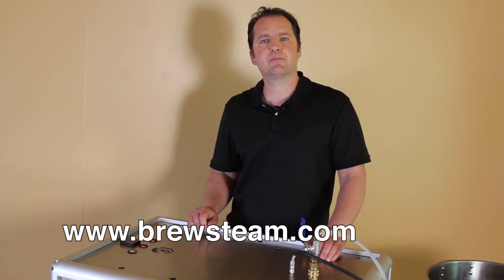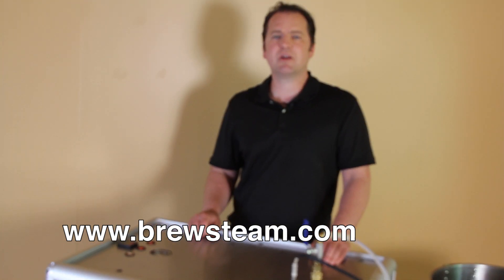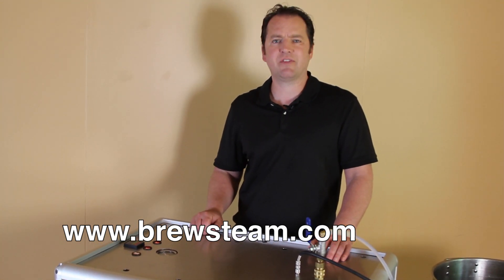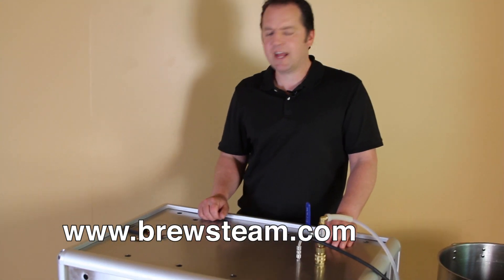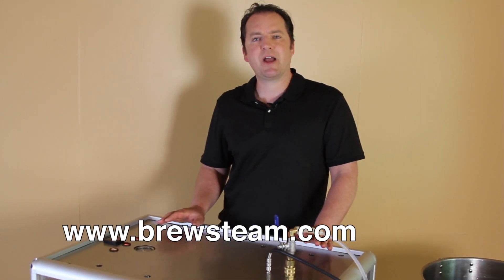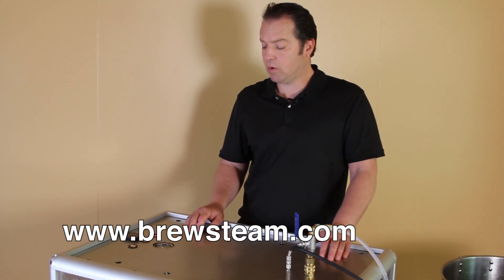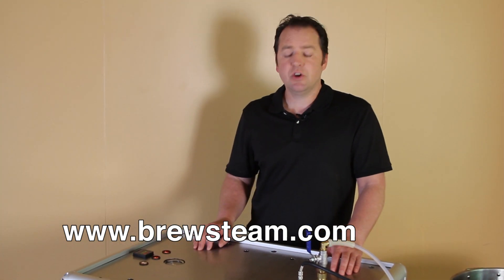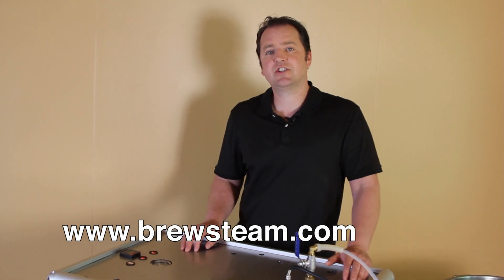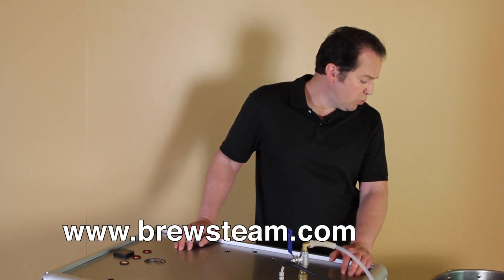Typically when you have a boiler system in a brewery setting, you've got an incredible amount of local and state regulation that's going to require you to have a bomb-proof room and have people come and inspect your boilers. We've gotten around that. The reason how we've gotten around it is we have a 30-liter stainless steel boiler. We're only running at 1.5 bar, which is just a little over 20 psi. We don't follow the regulations as a standard steam jacketed boiler. So we are really unique.